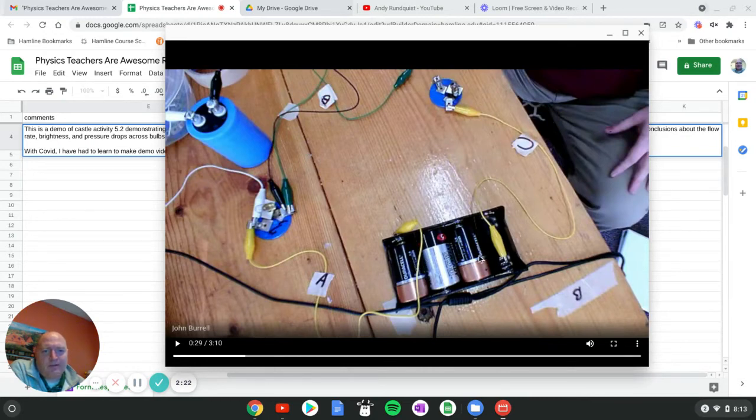So this is 1.5 times 3. So this is 4.5 volts here right now. And so he said long bulb and round bulb. So I guess these are 2 different types of bulbs. So that's pretty cool. Let's see, and a big honking capacitor here. So what I found with the gigantic capacitance capacitors, meaning in the range of a farad, right? Normally instead of micro or nano, they have super cool properties, except that they can sometimes have some internal resistance. They can have some impedance, right? So sometimes they don't seem to work exactly like you would expect a normal capacitor to.